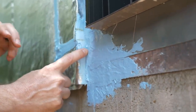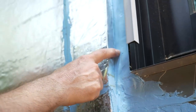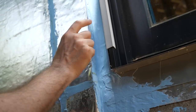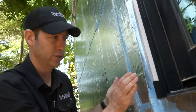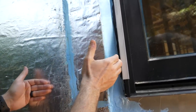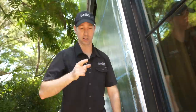That metal is actually coming to here on the outside — it has a wing, so to speak — and then it's coming up another inch or two on the side of the house right here. This door happens to have a nailing flange on the outside, from a window manufacturer, so we're able to use that fluid flashing on the door. This little gap you're seeing right here — this is also a recessed door just like a window — so the stucco is actually going to recess back in here, giving a nice detail.